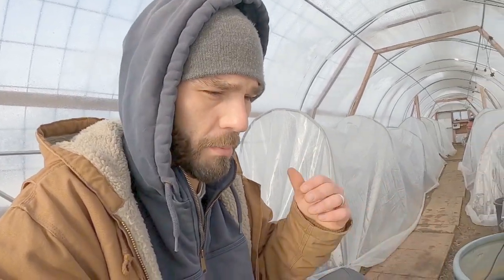Sitting about 80 degrees coming out of the box right now is very cool. 80 degrees coming out and we're sitting about 50 degrees inside the greenhouse right now. So we're going to run some math — I want to show everybody how to figure out the BTU potential output and calculate that up.